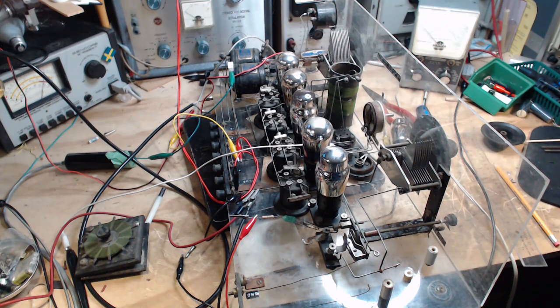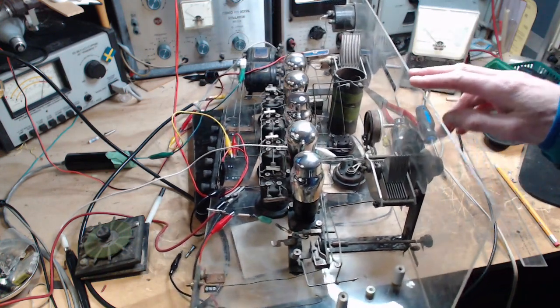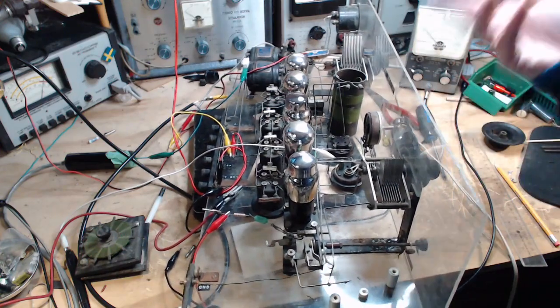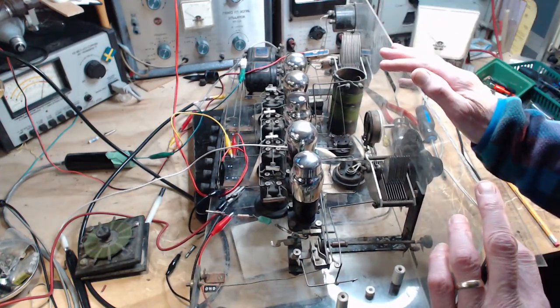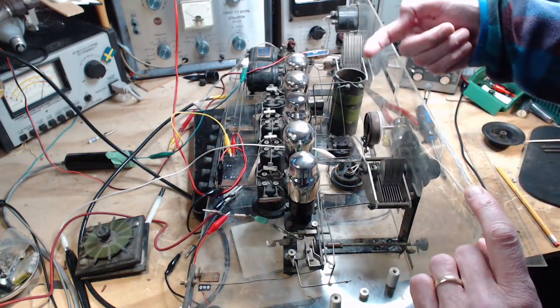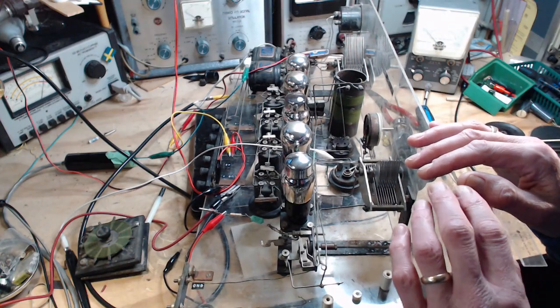And really what would make it an Ultradyne is the specialized oscillator mixer circuit that would be in this radio. And it would involve two tubes. One would be an oscillator tube, like most radios. Probably in this radio it's the tube that sits here. Produces a local oscillator, fantastic. Feeds it up into a mixer tube, which in an Ultradyne is called a modulator.